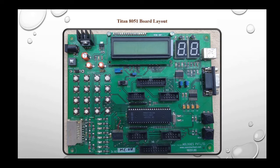Apart from this, we also have various jumpers on board. The user can configure the board according to requirements. Jumpers J4 and J5 select USB to serial or UART. When pins 1 and 2 are closed, USB to serial is selected; when 2 and 3 are closed, UART is selected. Jumper 3 selects the backlight of the LCD. When 1 and 2 are closed, the backlight is OFF; when 2 and 3 are closed, the backlight is ON.